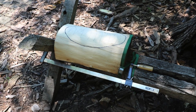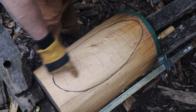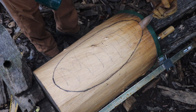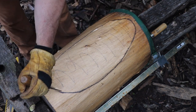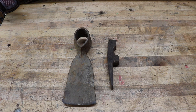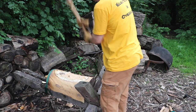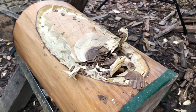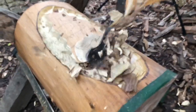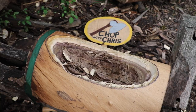Now we're all set to start carving on my outdoor workbench. The grain goes in this direction, so if I start wailing on this with my adze it could split all the way out. So I'm going to chop out this ellipse very shallowly first, to break the grains around so it can't do that. A friend of mine is a blacksmith and he made me an amazing adze from a garden mattock. I made the handle from hickory, and its three-quarter length enables very accurate strikes. The wide edge just eats through the wood, and the long blade allows me to chop deep into the log.